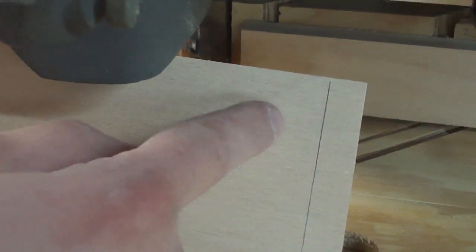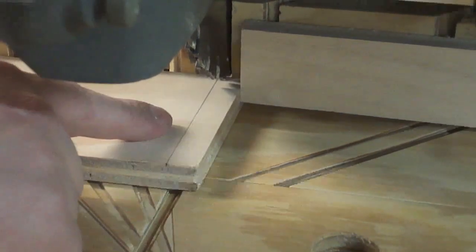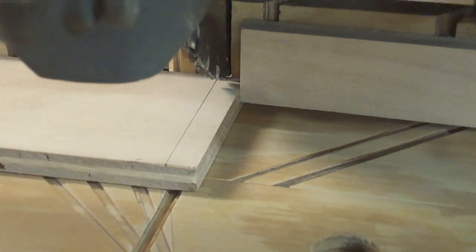I've gone ahead and laid out a line at the back edge of where the drawer front is going to meet the drawer side. This is a scrap piece of wood for setting up, but other than that it's exactly the same. I took this layout line and lined it up with the outermost tooth on this dado head. I took the regular saw blade off the radial arm saw and replaced it with two blades in a dado set, and that will give me a quarter inch wide groove — perfect for the lock rabbet we're going to form on the front and back of the drawer. Let's go ahead and test this out on a scrap piece. It's a lot easier to try it on scrap than to mess up the actual drawer side.